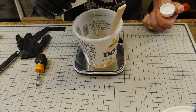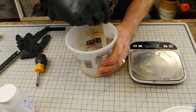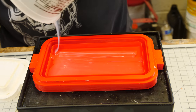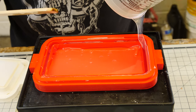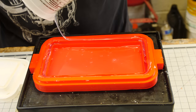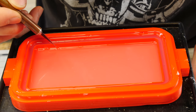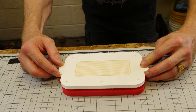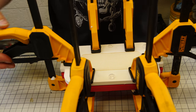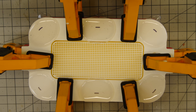One of the things I like about prototyping is that you can make more than one. In this case I want an alternate or backup silicone collapsible container using a slightly altered method. We're still using the same silicone and pouring it into the mold following the same process, but this time I'm going to pull it out of the mold much sooner — in its green state after only about two or three hours of curing. I clamp everything together, only lightly — I'm not smashing them — I want the silicone to come out naturally and take all the air with it without squeezing or destroying the mold.